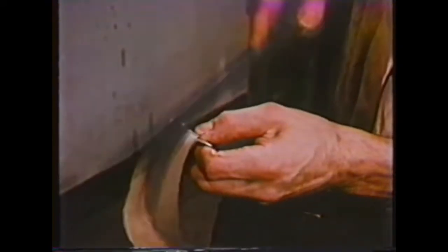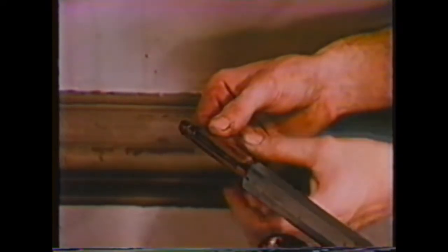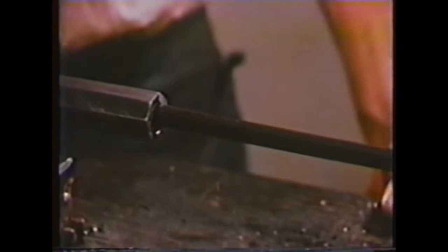After the first seven grooves are pulled through, the depth of the cutter is increased by gluing a paper shim on the hickory backing. The papers are glued on to keep bits of metal from getting between the paper shim and the backing. Putting on a piece of paper increases the depth of the cut so much that the bit is very hard to pull through the barrel. Once the first two or three passes are made, the paper is compressed and is easier to pull through. Altogether, eight to ten paper shims are built up and pulled through during the cutting of the grooves.